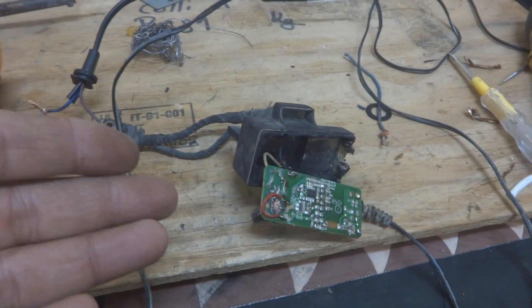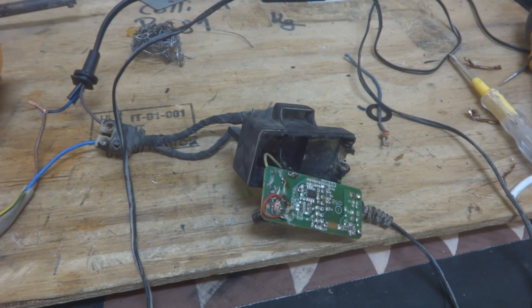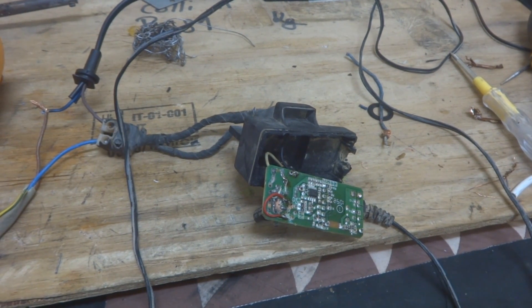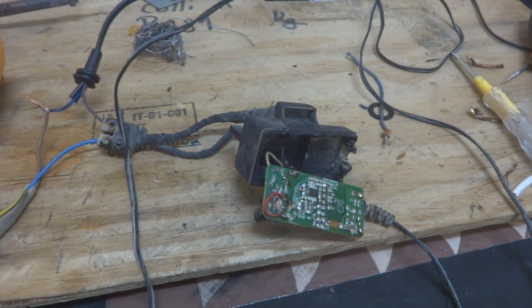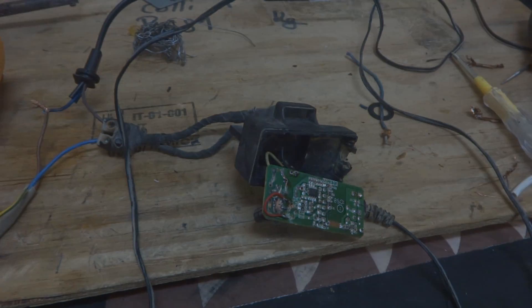These supplies are not expensive, but if we throw them away for such a small problem — a blown fuse and a burnt PCB trace — that's wasteful. We repaired it with just a piece of wire for the fuse and another wire for the trace, for no money, just some time. This is a successful repair — it will give new life to the unit. Thank you for watching, keep watching, stay tuned, subscribe and like.